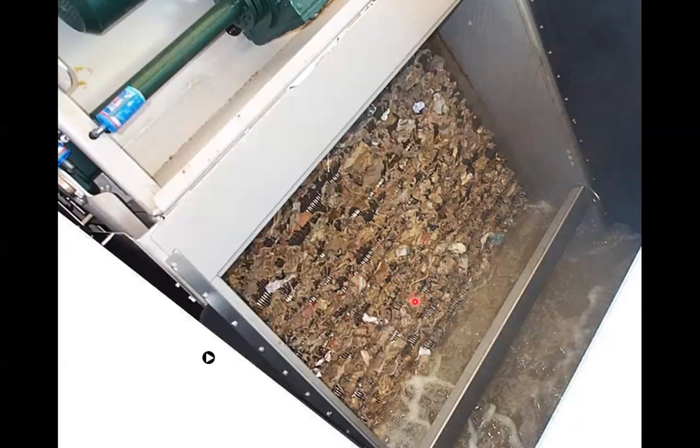So there's two ways you can operate these. If this is a final screen for your plant, then the concept is that you have an ultrasonic level sensor or some sort of level sensor or switch upstream of the screen. Once the water level builds up, you take a couple of steps. So it steps once, twice, three times. And what that will do is provide enough clear opening down at the bottom of the screen to let more water through. But it will also let water continue through this built-up mat of material on the face. And the advantage of that is that it captures a lot of the finer particles. So this is a very effective and cost-effective way of removing about 75% of the debris from your channel.